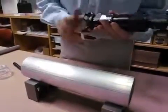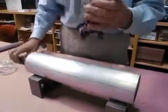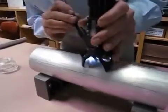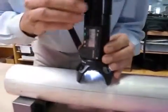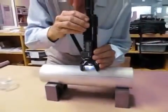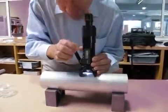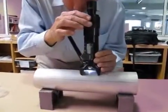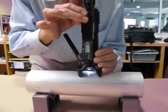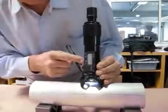We'll attach that and I'll try to find a defect on here. I'm going to focus again on the good surface next to the scratch and set zero, and then focus down in. This one looks a little deeper — that looks like twelve thousandths of an inch deep.